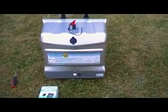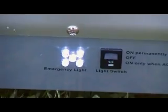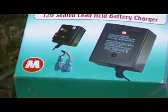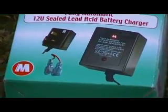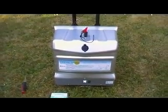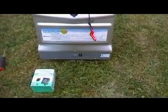I think this is how the battery went flat in the first place — a little LED light left on in the trailer for several weeks. When I went to get the power trolley it was completely flat. To rescue the battery I had to trickle charge it over 24 hours and I had to go out and purchase a 12 volt battery charger. The battery seems to work and is holding 12.9 volts, so I think I may have rescued it. Now I'll turn the isolator off and take the key out — and a moment later the LED light goes off, which is exactly what I wanted.